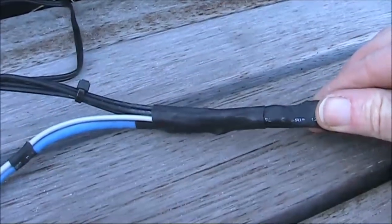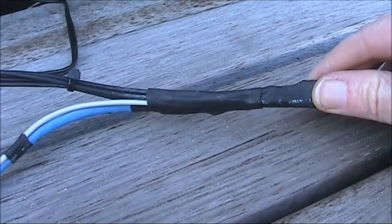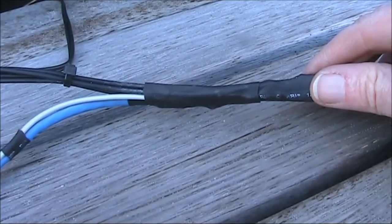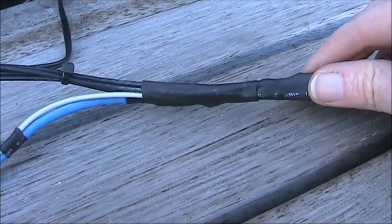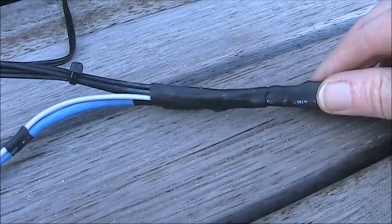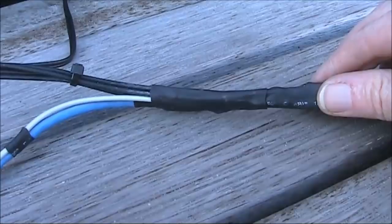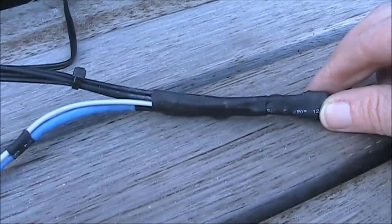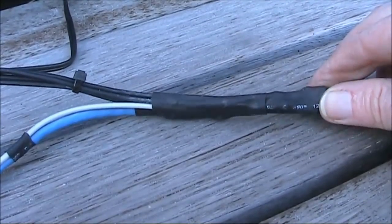What is this ugly looking thing? Underneath all the layers of heat shrink are two resistors and one capacitor for each of the audio connections. They form an attenuator. That's required because the audio coming out of the FT-817 is much stronger than is needed for the input of the computer, and vice versa. The audio from the computer is much more than what the FT-817's microphone input needs. Overloading can cause distortion on transmit and make receive signals less easy to decode, because they're too much for the computer's sound card.